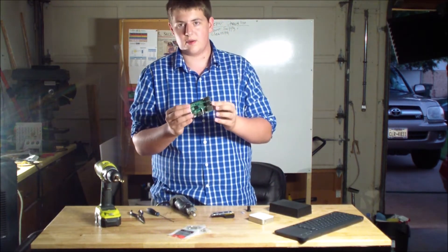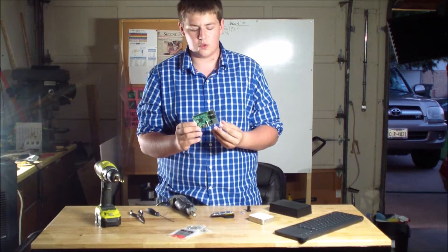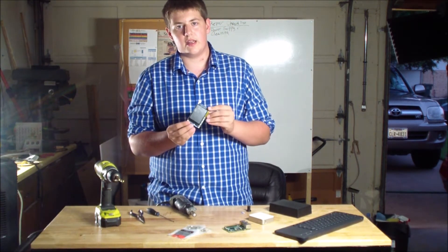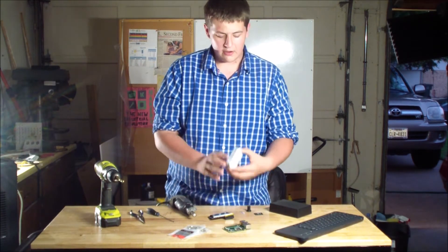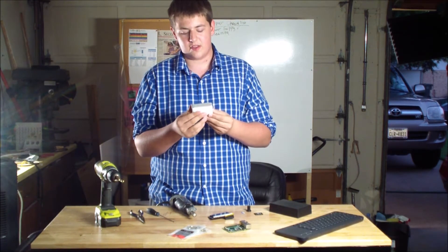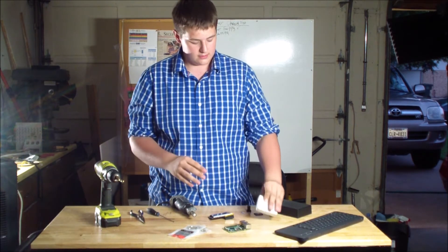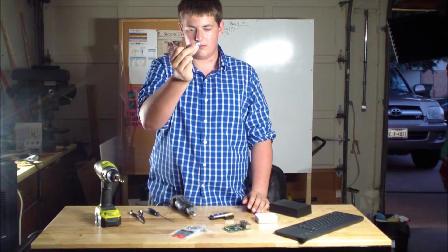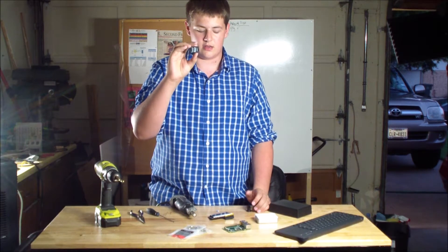First, of course, a Raspberry Pi. This is a $45 computer — this is the Raspberry Pi 2. For the screen, you will need a 2.8 inch capacitive touch screen from Adafruit. For power, you will need a USB portable battery pack. This one is a 5200 mAh battery pack and it has two USB ports. You also need, for the Raspberry Pi 2, a microSD card. And to load the OS on, you will need a SD card reader.